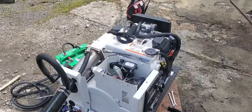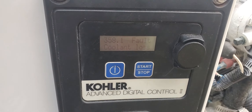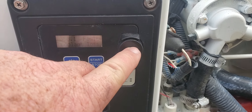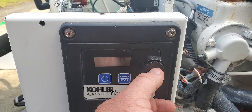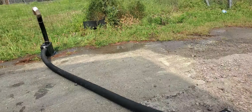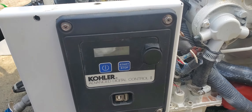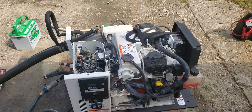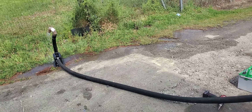And then it just shut itself off for some reason. Let's go take a look at what fault code it came up with. Coolant loss. Well, let's check that out — we probably had an air bubble. So what we'll do is confirm to clear the code by turning the wheel. Yes — we cleared it. Notice the water started back up again. That's how sensitive these are. They probably had an air bubble. We'll start it back up and let it run for a bit to see if that's what it was.